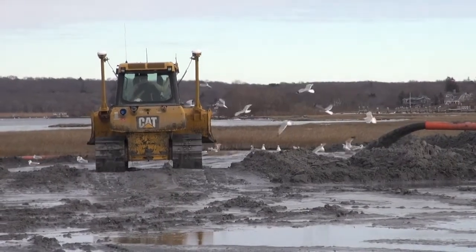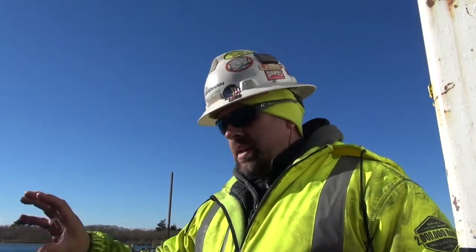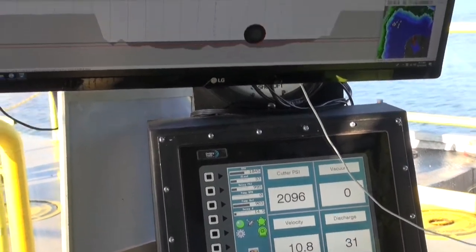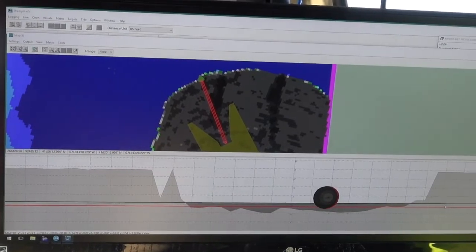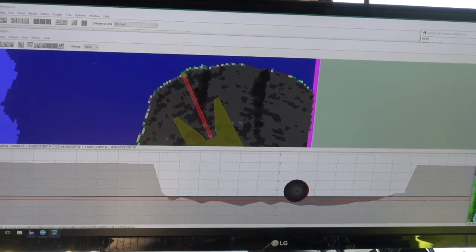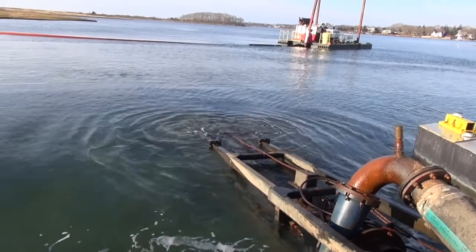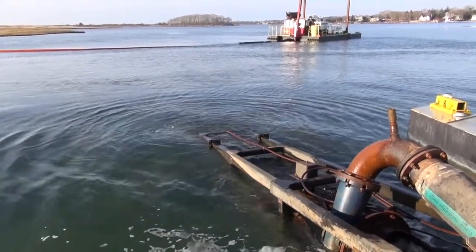We could have grade control going across the bottom at each level of indications on the dredge itself. There's a matrix on there that we follow on the computer screen. Once that is to our grade that is set, we just step ahead. It moves off of the back — it pivots off of the stern spud, which is that spud way on the back. So it'll pivot back and forth, and it has a 70-foot radius that we can pivot off of and move ahead. It'll move ahead at 2-foot increments.